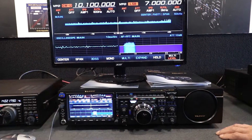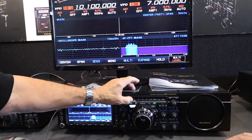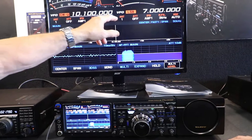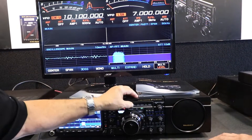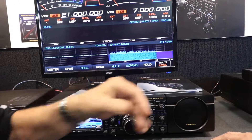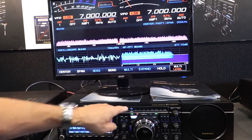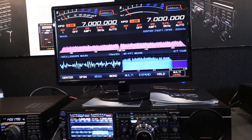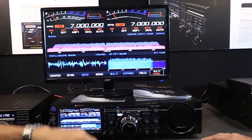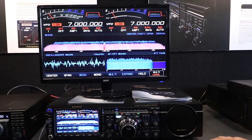Here's a really cool feature for contesting or DXing. If you press and hold this button, an orange light comes on — I've now band stacked this, putting 10.1 MHz into the stack. So you go over to 15 meters, do what you need, and when you want to come back, there's a marker so you know where to return. Just push the button again and it'll cycle through — three stacks. Band stacking is on a lot of radios, but this actually reminds you that you've got it stacked with the orange indicator light.